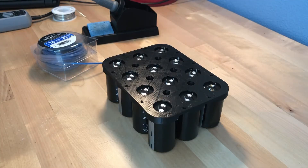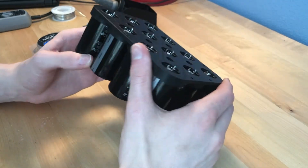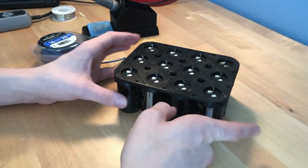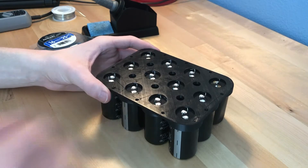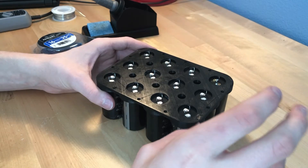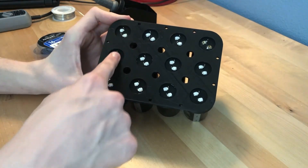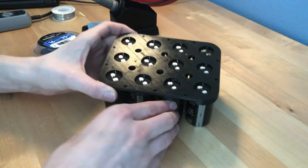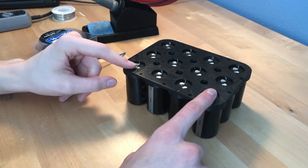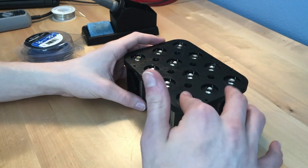I've got everything glued into place. It's not the best gluing job — definitely used too much in some places and too little in others — but it'll do. I paid careful attention to the direction I put these capacitors in, since I'm wiring them in series I need to connect the positive to the next capacitor's negative and so on. I lined them up so I can wire it down one row and up another, so the two electrodes for the entire bank will be at the two ends. I've got 16 gauge wire to wire everything in series.